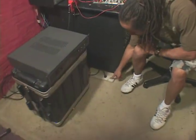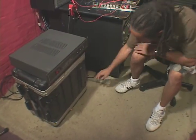What we're going to do now is power it up for about five seconds — power it very quickly, then turn it off, and kind of smell it and touch it to see if it's getting heated. If we have it hooked up incorrectly it'll definitely heat up or smoke or something. I have a power strip on the floor here which is connected to my power supply, and I'm going to turn this on first.